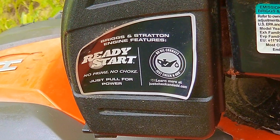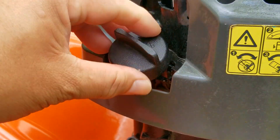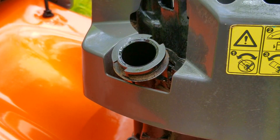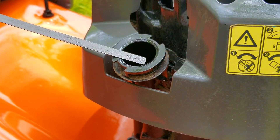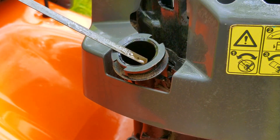The reason I forgot to drain the fluids is sometimes I pick stuff up and take them straight to storage without looking them over, which is not a good idea. I should at least drain the fluids so they don't leak anywhere. Another reason is to prevent a fire hazard at the storage. A third reason is to prevent the fuel system from being destroyed by the gasoline over a long period of time.